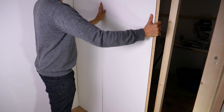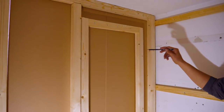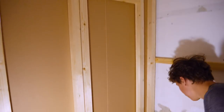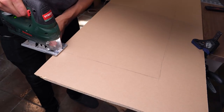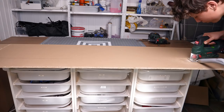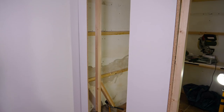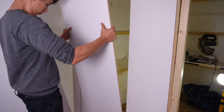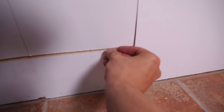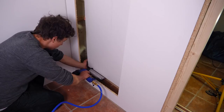The next focus is wrapping this up in a wall-like facade so it doesn't look too obvious. First, I fastened the wall sheets in front of the door, went to the backside of the wall, and traced the entire door on the wall sheets. Then I took the wall down again and used a jigsaw to very roughly cut out the shape of the door. When everything was cut out, I reattached the two pieces of wall sheets that now have a huge hole in them. To lift the door into place, I had it resting on a couple of nails and then used my nail gun to stick it in place permanently.